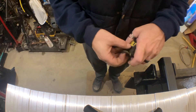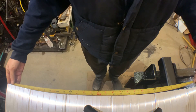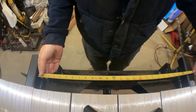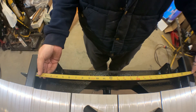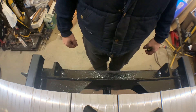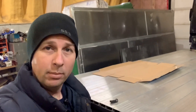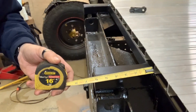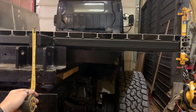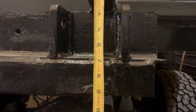The rear of the bed is actually going to be made out of three pieces. There's going to be one wing on each side and they'll be about 28 and a half inches wide, and then there'll be one section in the center that's about 25 and a half inches wide. All three of these sections are going to be about six inches deep — that's the space from the current bed to the back of the chassis. And then we're going to be about nine and a half inches high to go from the height of the deck board to just covering the subframe.